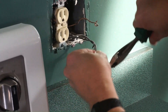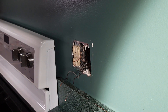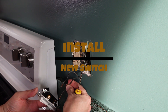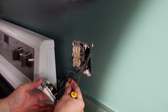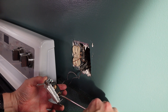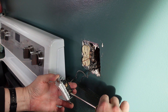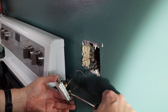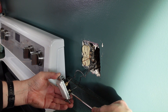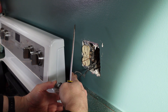You can curl these wires or you can go straight into where the screws are on the side — that's what I did with this one. You can see the screws on the side of the new switch. Just pop those in and tighten it down. If this is your first switch, I would just use a hand screwdriver. You can use a flathead or a Phillips; the screw is designed for both. I always use flatheads — they just seem to work better.